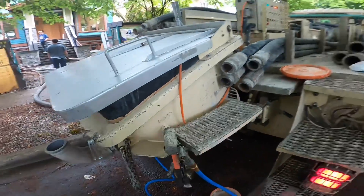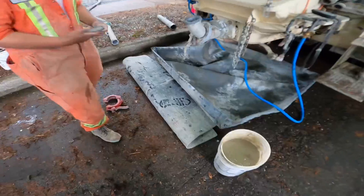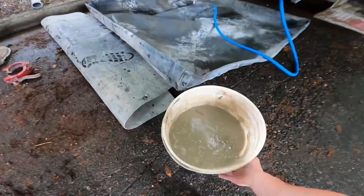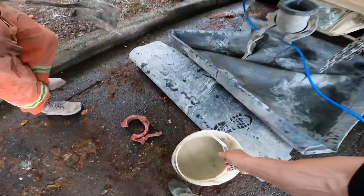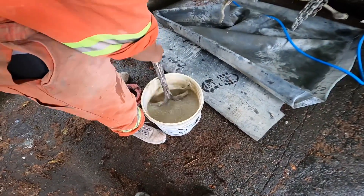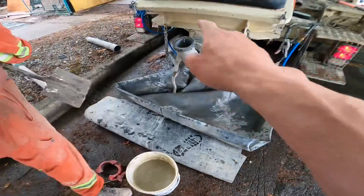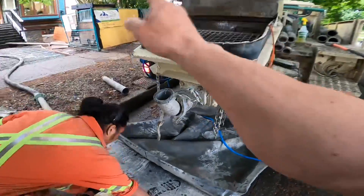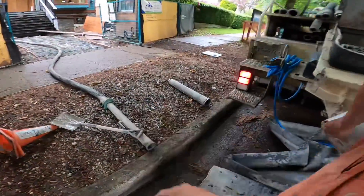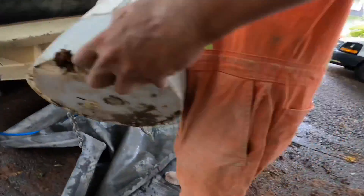I'm going to start laying some hose out here. Ian's got the bentonite — do a little demo here with the shovel, give it a little stir, to display the optimal consistency of the bentonite. Perfect — beautiful! Now we're just going to toss in the elbow here, throw a reducer on, tilt it over — not so far as to spill the bentonite out — connect everything up and we'll rock it through in one go.